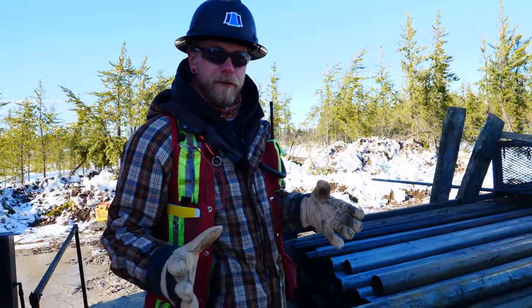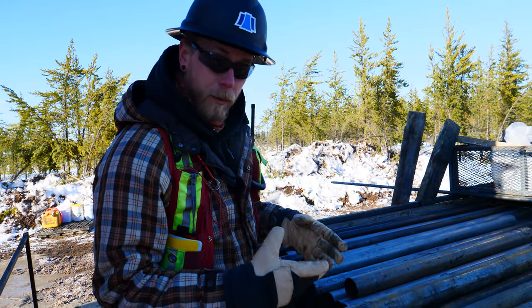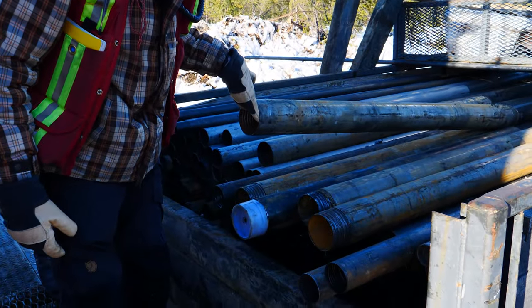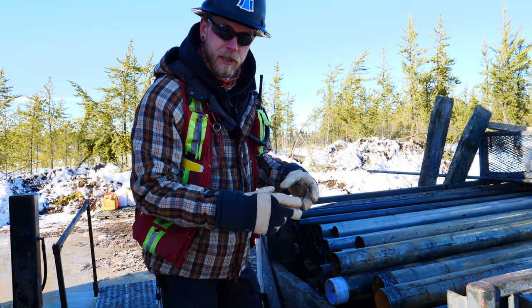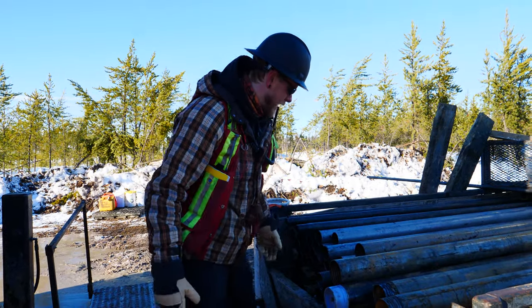So it's not just as straightforward as drilling a hole. What we do is we start off with a large diameter pipe. This right here is our HWT casing. What this does is we go down with that first, and that prevents any sand or cave-in into the hole and keeps it nice and tight, and then we'll reduce sizes down to HQ.